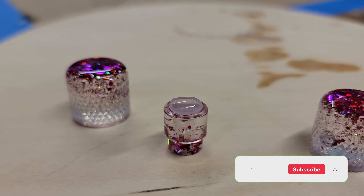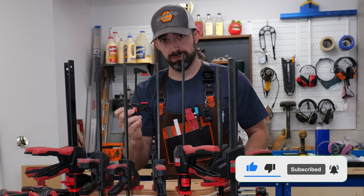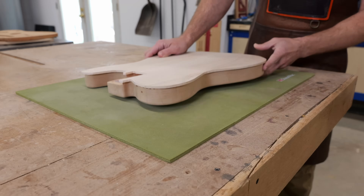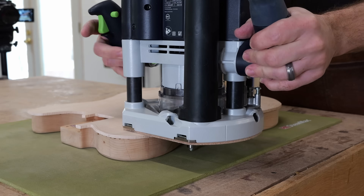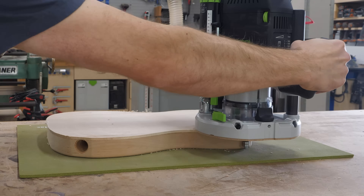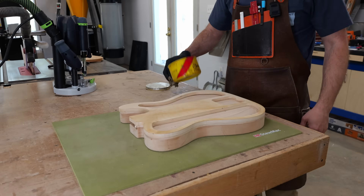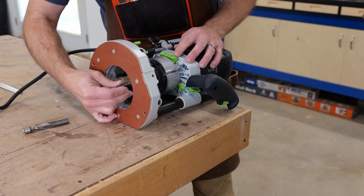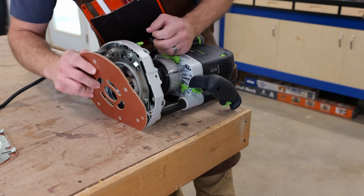Even though those turned out pretty cool, I'm not quite sure they're the look we're going for, so we did a little research and experimenting to get the knobs just right. I'm planning on going into detail in another video soon, so make sure you're subscribed so you don't miss it. With the glue fully cured on the guitar body I can shift my focus back to that. Before I can start hollowing out the body I need to clean up the extra material around the edge — for that I grab my router with a flush-cutting bit and go to town. Since I'm using a helical bit I don't have to worry so much about following the grain direction to avoid tear-out.